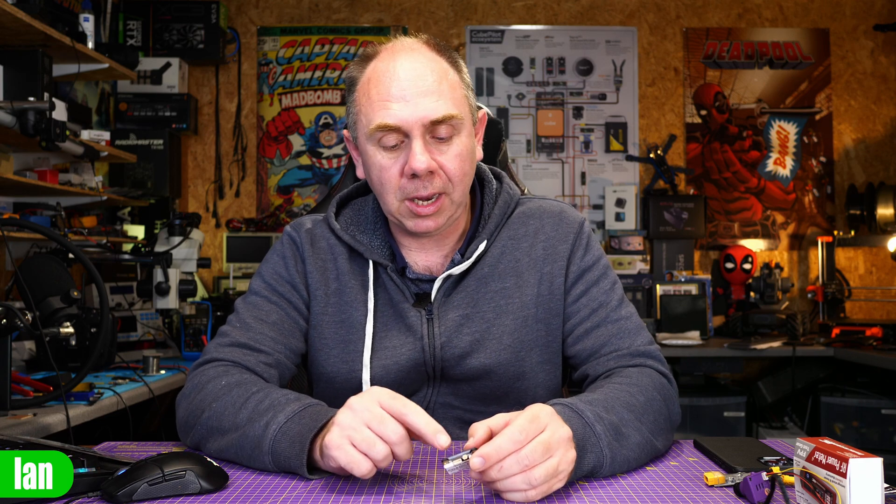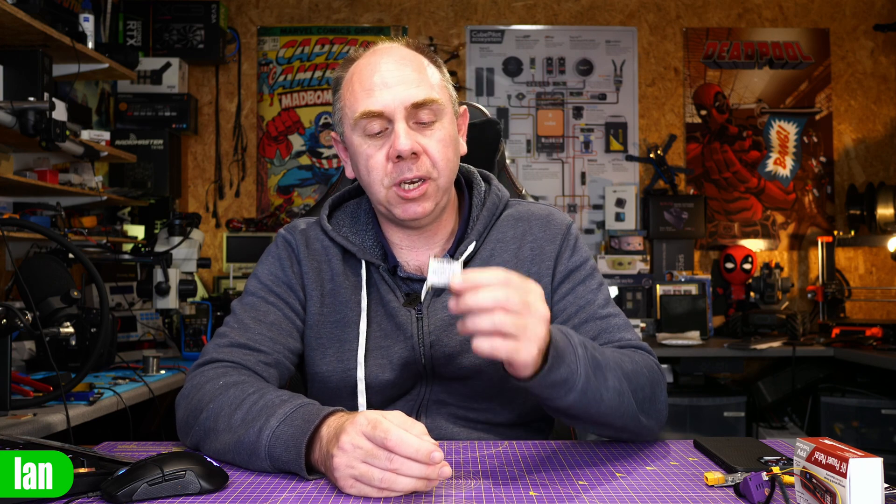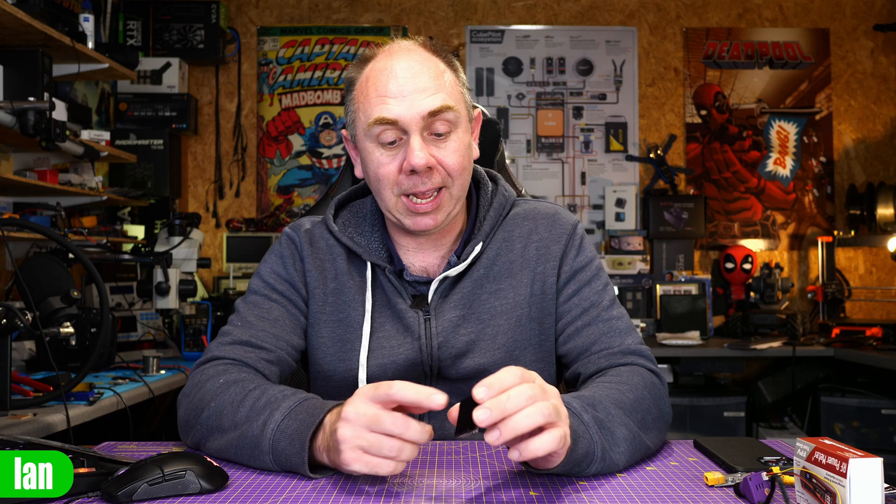The MMCX connector is not going to suit everyone, but personally I think it's better than having a UFL. You do still have the options for manually soldering wires if you didn't want to go down the road of a harness. One note I will make though is this unit does get very, very hot. On my bench testing at maximum output into a load, it got ridiculously hot very quickly. So do make sure there is plenty of airflow over this wherever you're placing it in your aircraft. It won't be so much of a problem on a quad, but if you're putting this in a plane, do make sure that it has the airflow. It has that heatsink on the back, so all you need to do is get it in the right place and that should keep the temps under control.